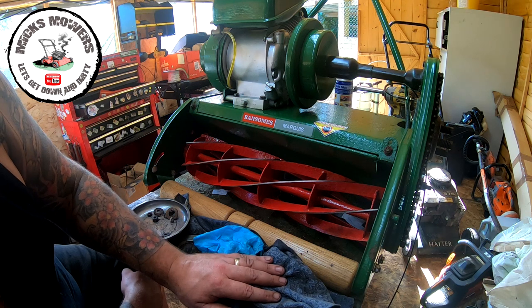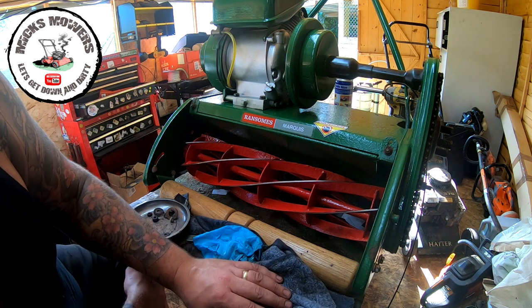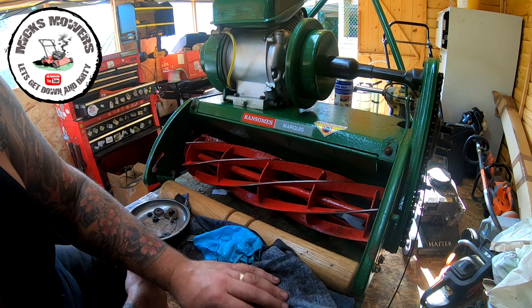I have a spare engine here — Pete Frowse's — which I can have a look at off camera to identify the piece. It'll be another day or two before the parcel turns up for the levers, but it'll be two or three seconds for you guys. So unfortunately it's not going to happen today, because I have noticed there are two parts I've dropped: one was a metal dowel rod about an inch and a quarter long, and the other piece was a ball bearing — a quarter-inch ball bearing — which goes in between the dowel rod and the plunger. I have since purchased some and they'll be fitted very shortly. Without that ball bearing in there, the drive is not going to do its action. So unfortunately the Marquis will not be run up today, but hopefully he'll be run up in the next video.